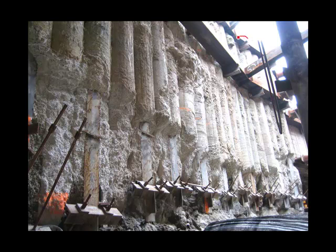What you see here is a carefully thought-out plan: at the upper level, the whaler is supported by a conventional brace that goes across the excavation. Then there is a system of whalers at a somewhat lower level, also with braces across the excavation. Beyond that, it is a freestanding wall until you get down to the lowest level, which is supported by these rock anchors.